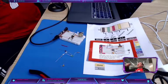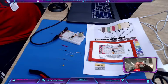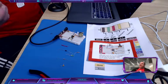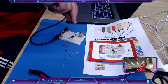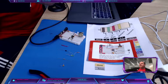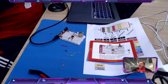Oh, in the last circuit, dumb me, what I wanted you to test, I completely forgot, is taking out the green LED, so you could do this at home. Take out the green LED, replace it with the self-flashing LED, and see if you can control it with the potentiometer and your 555 timer. See if that works.